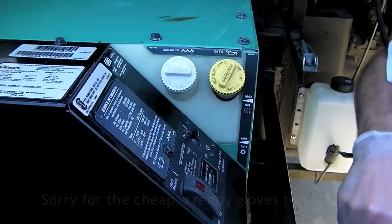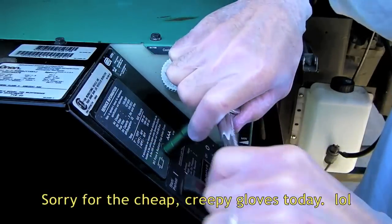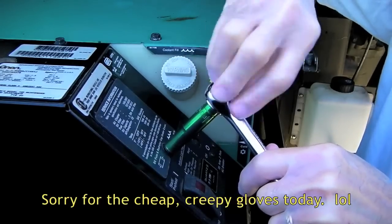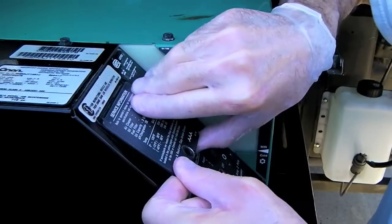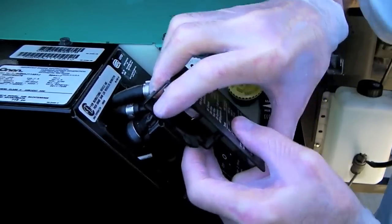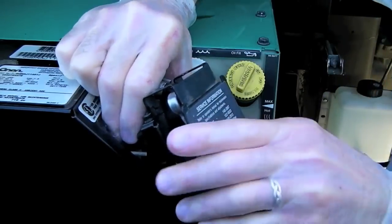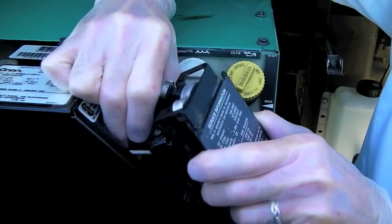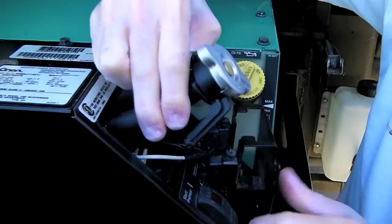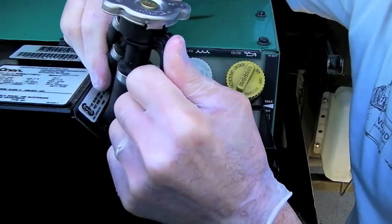It's now 24 hours later, and we want to go back in and inspect the level of the coolant in the fill tube. We ran the generator good and hard yesterday, and now we want to see if the coolant is still up to the top of the fill tube or if more air has worked its way out.